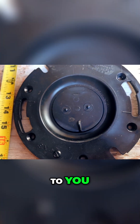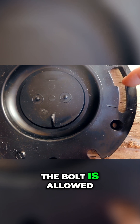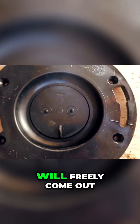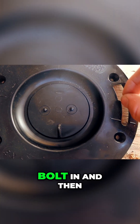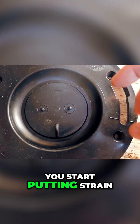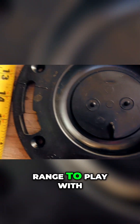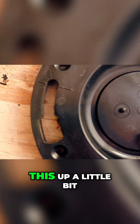What I want to describe is that we have a range here of where the bolt is allowed to be secured. The only thing we're trying to avoid is the largest parts, because that's where the bolt slips in and will freely come out if it gets into that area. You stick the bolt in and slide it into an area where it doesn't come out when you put strain or tension on it. If we're not dead on with 13 and a half, we still have this range to work with.